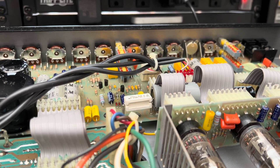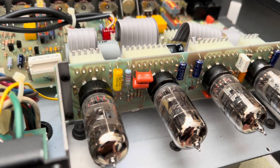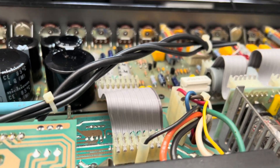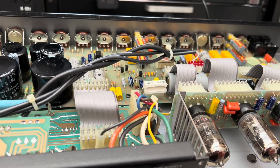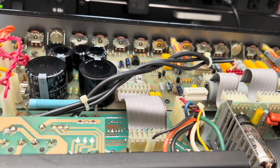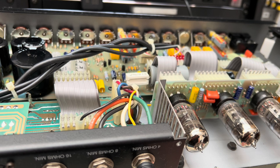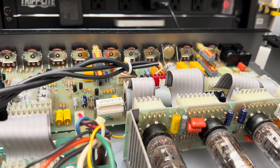Now she's loud and proud. I'm going to go ahead and go through the rest of the amp. Even these old Peavey tubes are still fully functional without any noise. So Silvio, I'll go through and check the caps, the high and low voltage supplies, go through the power amp and the resistors, and check all the voltages at the sockets. We'll take it from there, but otherwise it seems like we've resolved the issue — update later.